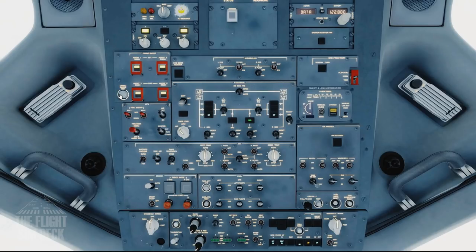Then run the cargo smoke test, and go through all the GPWS warning system tests — these include glide slope, pull up, terrain, sink rate, don't sink, too low gear, too low flaps, bank angle, and caution terrain callouts — verifying that they all work correctly.